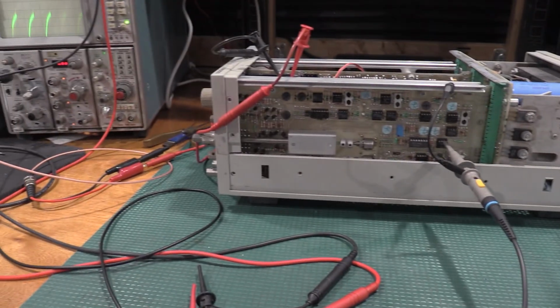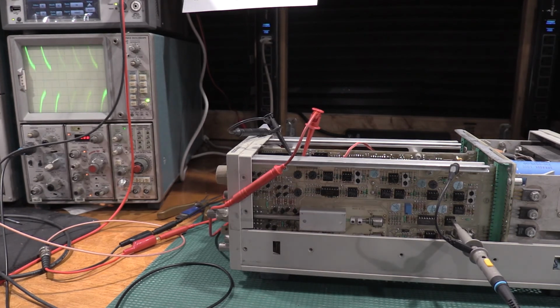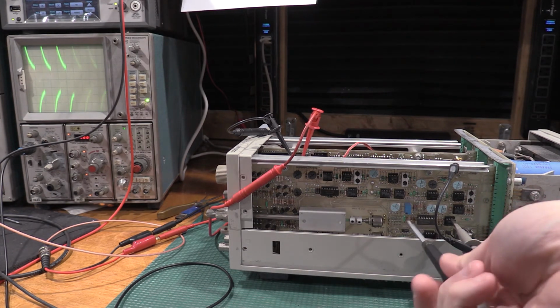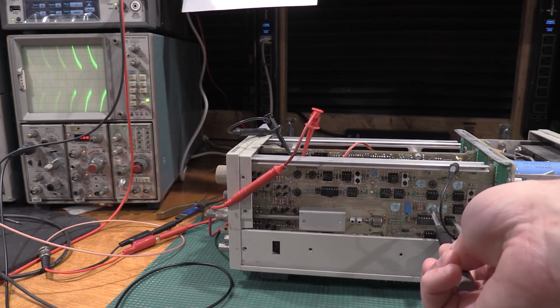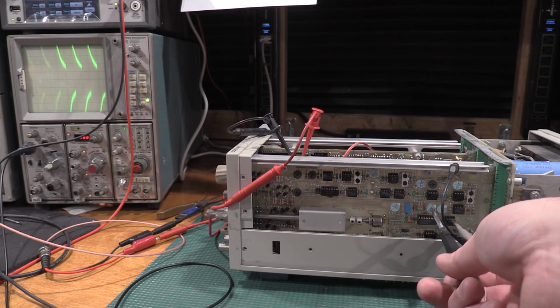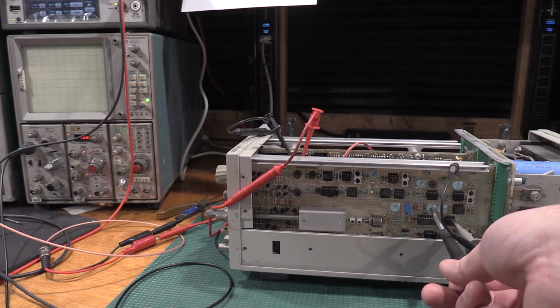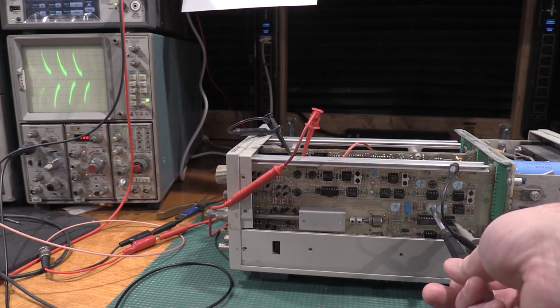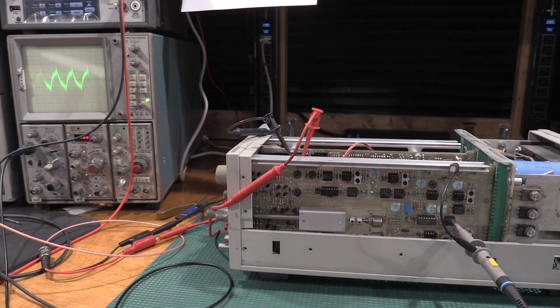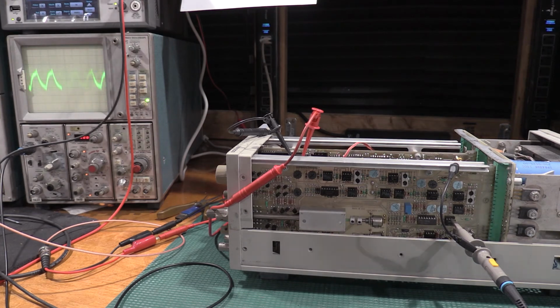And then on the scope, our offset's off quite a bit actually. We adjust R1726. For right there, minimal deviation. After that, we remove all test leads and reattach the potentiometer.